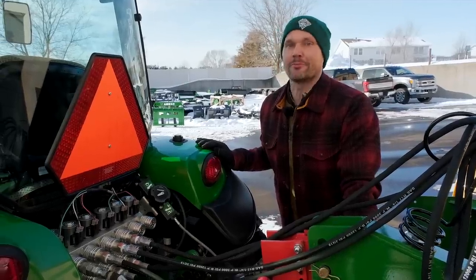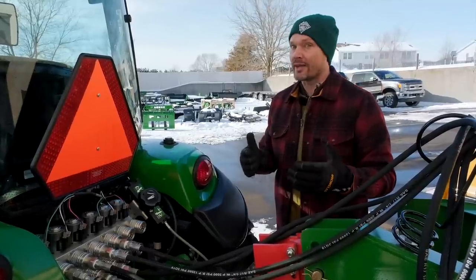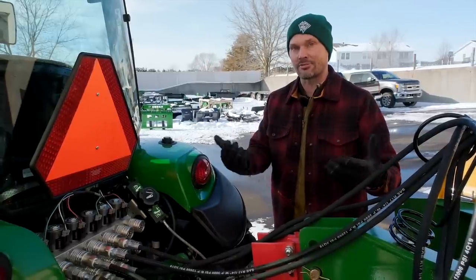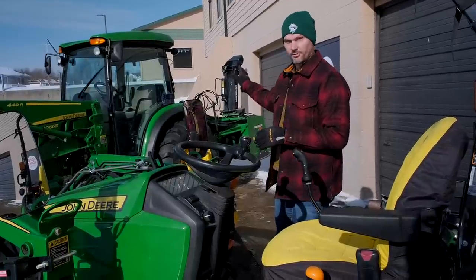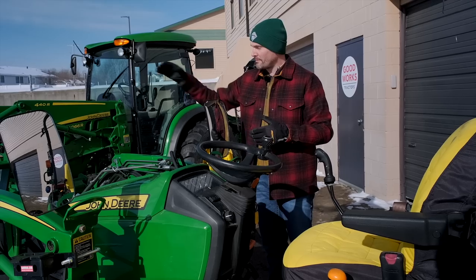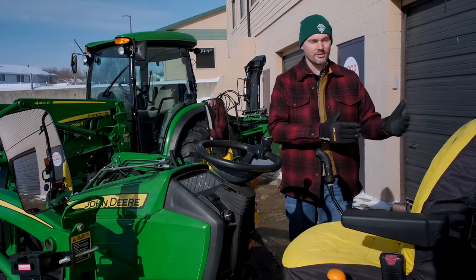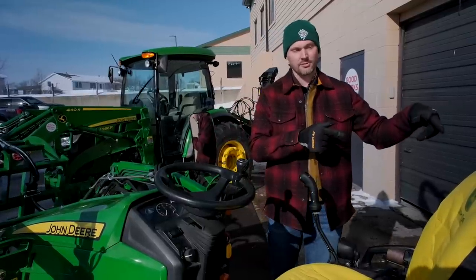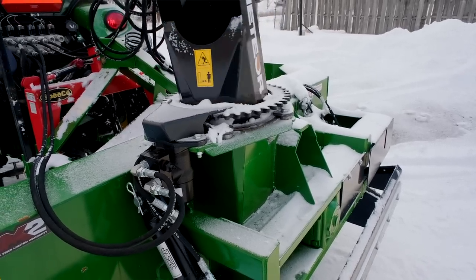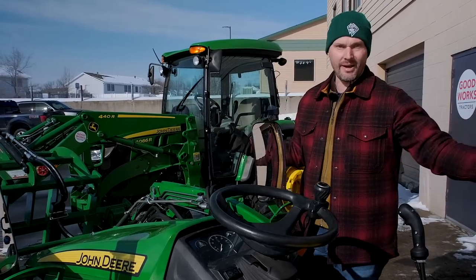So if you're new to the tractor world, welcome to the confusion. You just need to have a good understanding of what that third function capability can do and realize there's a way to route that functionality towards the front of the tractor or on the backside. Having that additional hydraulic circuit — that's the important part. Similar to the factory third function on the 4066R, a diverter kit giving you that third circuit could be mounted up front or also mounted on the backside. The tractor does not care either way. If you have something mounted on the backside like a snowblower that needs hydraulic chute rotation, that's where you want the third function. Or if you need that third circuit up front to control the grapple, that's important to you as the operator. A third function, in my opinion, could be mounted on the front or on the back — it doesn't really matter.